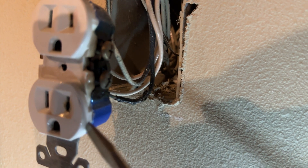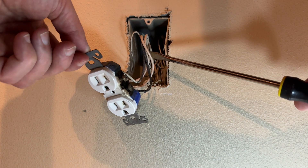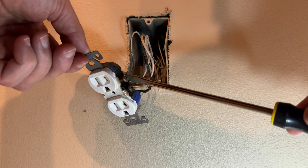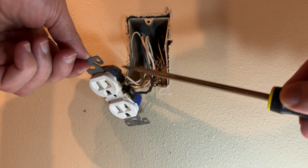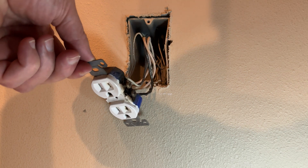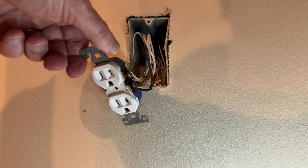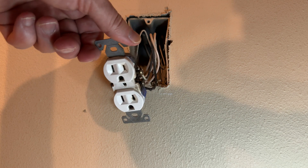So I'm going to have to take a closer look at this outlet, but for right now I am going to remove the outlet and replace it with a new outlet. Because I have plenty of wire here, and some of these are melted a bit, and it's hard to get the wires out. What I'm going to do is just cut the wire close to the outlet and remove it so I can investigate this outlet without disturbing it too much.